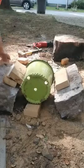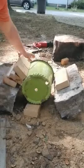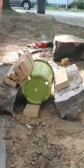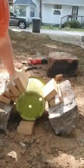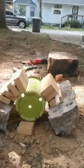And now you're just going to keep doing that all the way around this arch. A little bit of mortar, blocks, mortar, blocks, all the way around. You're going to want to stagger these gaps, or else you're going to end up with several narrow bridges. So I wouldn't do it like that. I would grab a longer block that would span both of these and put it in like that. So I keep coming up and around, a little bit of mortar, another block, keep it coming. That one didn't need it for the particular angle that it was at.